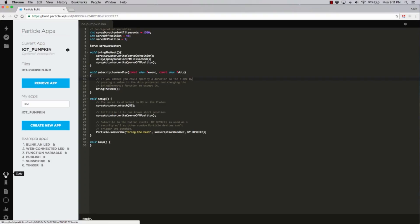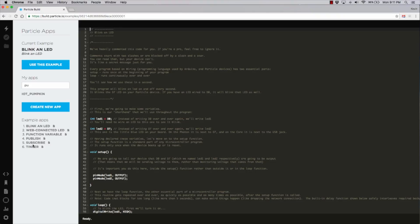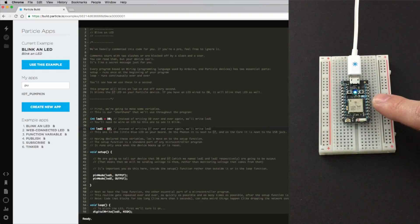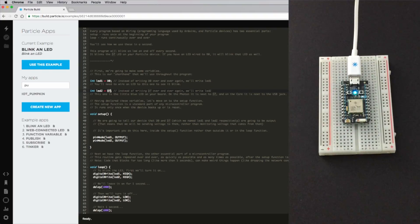Let's go back to the code. The easiest way to get started if you've never used a Photon before is they have this example app section at the bottom. We'll go ahead and click on blink an LED. This is an extremely well-commented piece of code for the Particle Photon — it tells you everything. If you're brand new and don't have experience using Arduino, which is a lot of how the programming language feels here, this will walk you through every single instruction and what each of them does. In this particular example, there are two LEDs — one connected to D0, which we do not have, and one connected to D7. D7 is a special onboard LED on the Photon, right next to the D7 IO pin. That is the LED we are going to turn on and off.